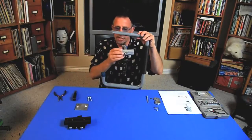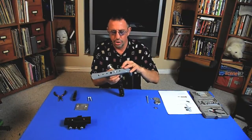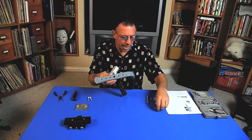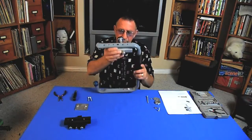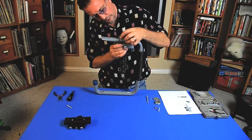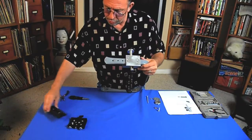If you're not going to use the bridge plate, you can take a quarter-20 one-inch machine screw, come up vertically, and take two screws to secure the Lowell Interlink, then secure the camera plate onto that upward-facing quarter-20 screw. That's a less expensive way, but it's not as secure or stable as using the bridge plate. I'll show you using the bridge plate first — I can take my plate and screw through the brace into the Lowell Interlink to secure the bridge plate, giving us a nice platform to mount the camera plate.